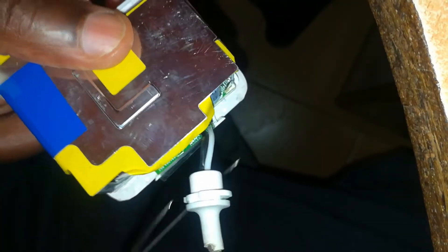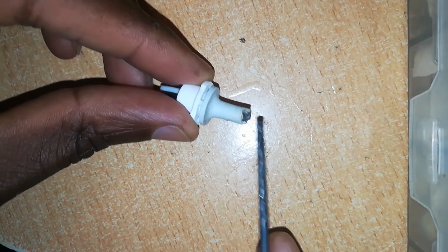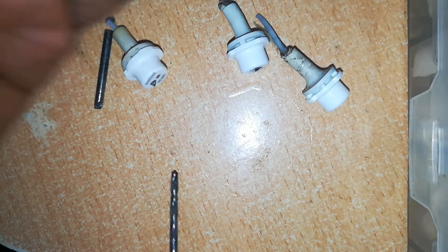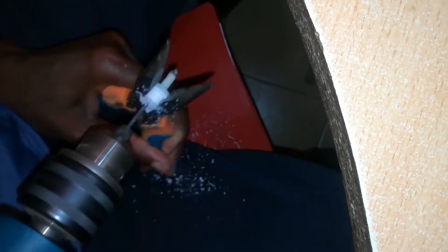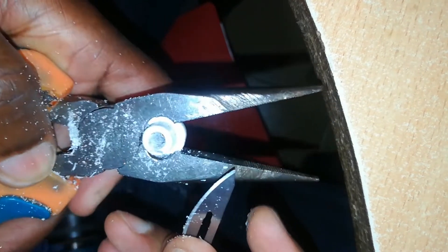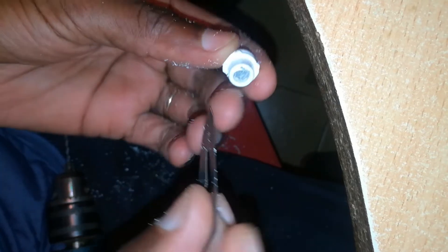Here's the inside of our charger. What we'll do first is cut off this junction. You can see from the ends right there — it's been destroyed. We won't be using this; fortunately we have a few more collected over time. Here's where your pliers become important — use them to hold this junction just like that, and now we drill right through there. Trim off the edges with your razor for a nice neat hole. We'll put a wire through there and it'll come out to that side.